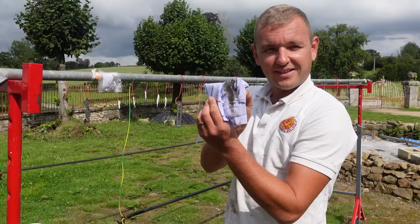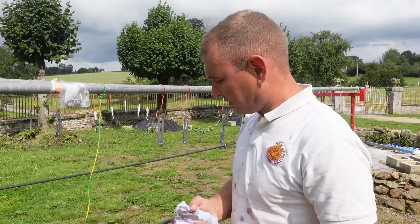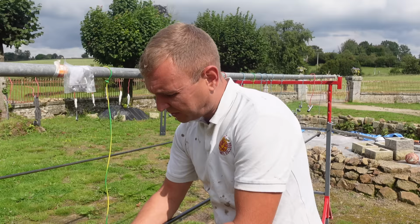And this is what I mean. If we don't do this, the paint doesn't stick and we have to do this over and over again. So just to get all this, the excess oil from when they've been welded together and been manufactured, we have to make sure that they're absolutely spotless before we start this process, because otherwise there's literally just no point.